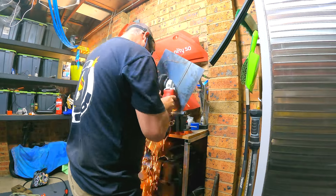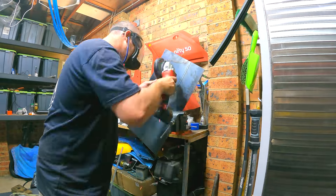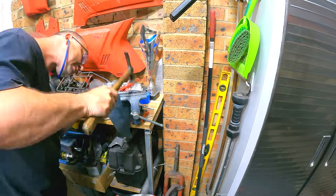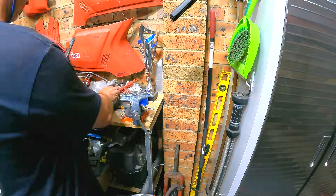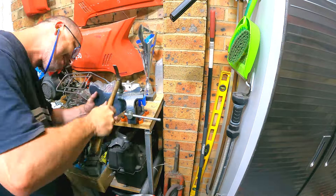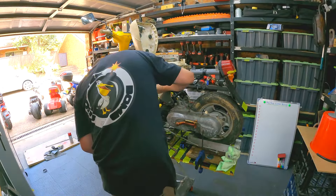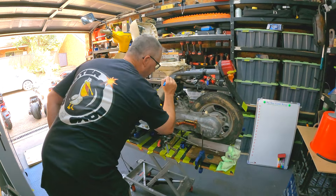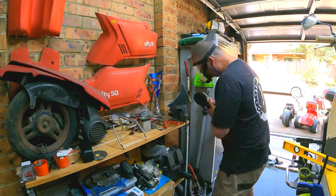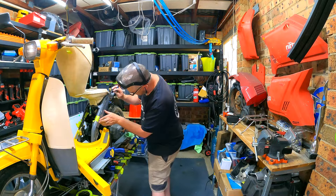Now it's time to transfer my template onto the sheet metal. Since the Pesola frame is considerably narrower than the 3KJ Jog engine, I had a sheet metal place put a mild bend into the steel that would allow it to angle out from the frame down to the engine. Strength is an obvious concern — to overcome this, I rolled an edge by hammering it over right the way around. I used a thick piece of metal as a dolly to round that edge and increase the strength. When you couple this with the bend already in the steel, this is now an extremely strong piece of structure. Once happy with the shape of the plates, it was time to test fit them — trial fit and trim, over and over, slowly sneaking up on it.